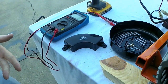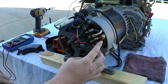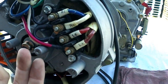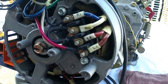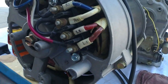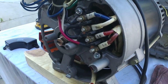So you know the capacitor is good. The next thing you would go to would be testing your ohms across your main outputs. You see you have a 120V circuit up here, then you have another 120V right here — combined, this makes up your 240 volts. To test your ohms, you just need to test between these two 120V circuits. We're just going to take this voltmeter, put it on your ohms reading, which is that symbol right there, and we will do some testing right here.